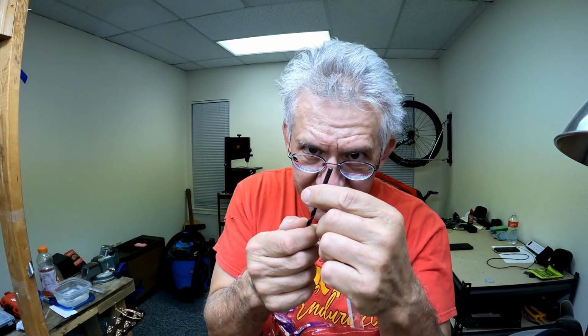And I am really looking forward to trying this out because I don't drill through the template. I just use it to mark. And what I'll probably do is get a drill bit that fits this. There we go. This drill bit fits it, 11/64. So I would use this drill bit to punch the holes, and I'll set this on the thing and I'll give it a tap. I have two marking sticks for the LMI. That's how I find a better way to mark through there.